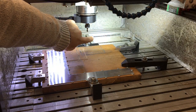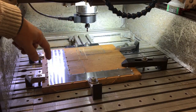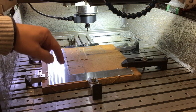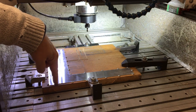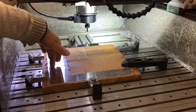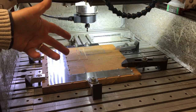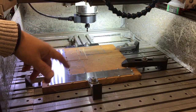I've got a 6mm 2-flute carbide end mill in there. It's a pretty old one so I don't mind if I actually break it. I've got my 1000 grade aluminium - this is the really gummy stuff. I'm just going to manually bring the cutter down to here and then just cut all the way through, keep feeding until somewhere around here, the aluminium will come onto there and hopefully stall the spindle and trigger the e-stop. Fingers crossed, here we go.